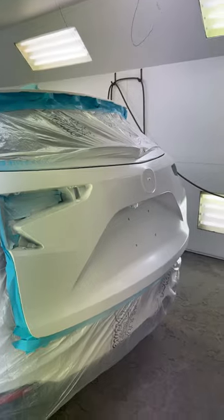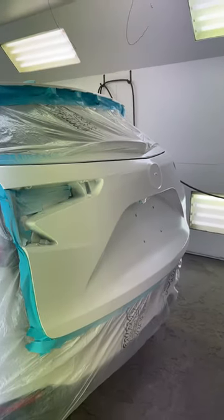If you don't let it dry and you try to tack that off, it's going to catch on to a soft spot or a wet spot, and you're going to have an absolute nightmare trying to fix that quickly before you clear. On finishes like this, I typically let them sit for 30 minutes before I clear coat.